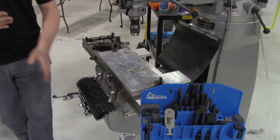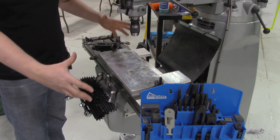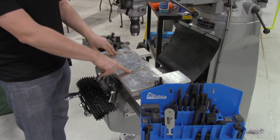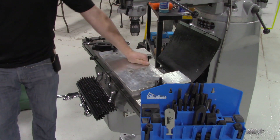In fact, sometimes that's a good way to do it. You cut something to the overall size a little bit larger than needed, and you know you've got a couple of holes that you need to drill in it — go ahead, drill those holes and use those as your work holding fixturing to keep your part locked down and in place.